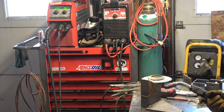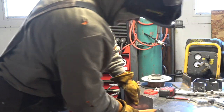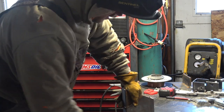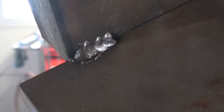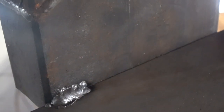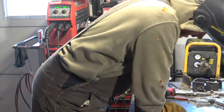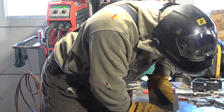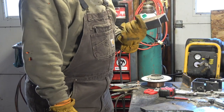So you could hear it — I guess people describe that as like a bacon frying sound. I weld a lot more than I fry bacon, so it doesn't sound like bacon frying to me. That's what we had there — it just looks like a normal MIG weld. I'm pretty sure I can get this to break real easy, and yeah, by hand it just broke.